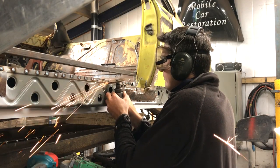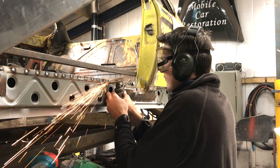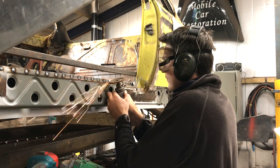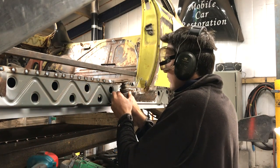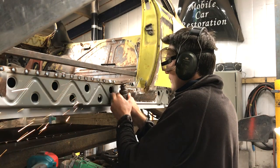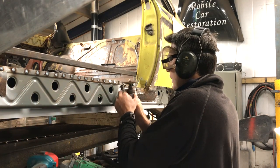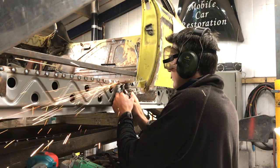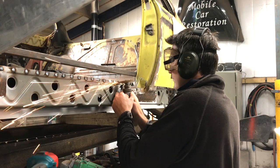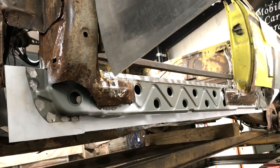OK, back to the job in hand — grinding off all these plug welds. I used an 8mm diameter plug hole. The punching tools available specifically for this purpose are usually around 5mm, which is too small for a consistent result. If you don't start the arc right in the middle of the small hole, the weld can bridge the gap and not fuse the panels together. The reason these tools offer a hole that is too small is to do with the force required to punch a bigger hole. I used my fly press or a Roper Whitney hole punch — more expensive tools, yes, but the plug weld never fails.